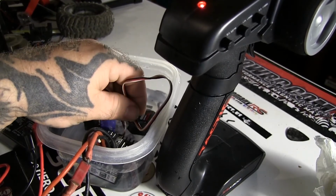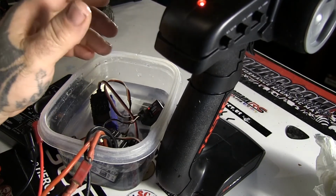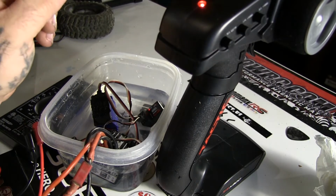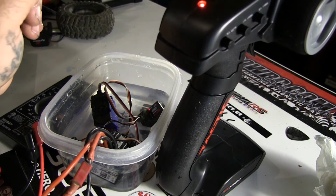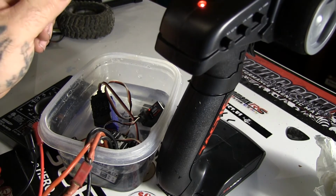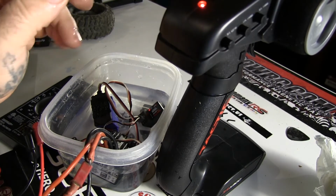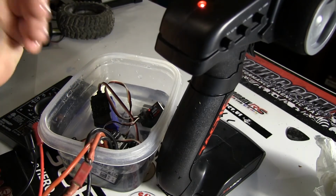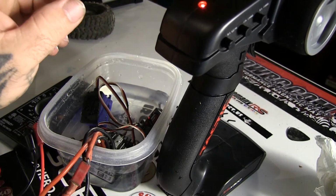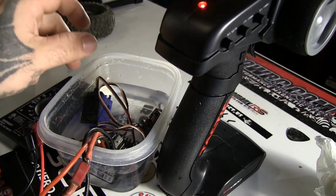Like I said, I've used it to coat servo boards because I don't want to have to wrap my whole case with stuff, and I'm not a big fan of plasti dipping stuff. I've had issues with plasti dipping things not cooperating and failing. And I've even had issues from time to time with liquid electrical tape, with it developing tiny air pockets over time with heat buildup. That's another thing with the grease, it allows the heat to dissipate through the grease, where some of the other stuff doesn't allow so.